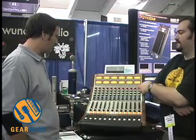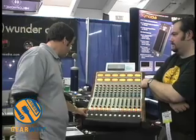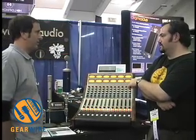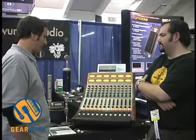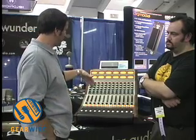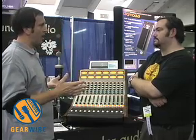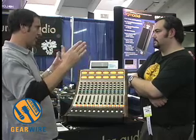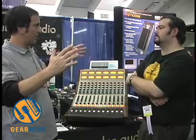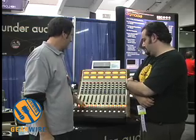The standard comes with a P&G conductive plastic fader, but you can upgrade it to flying faders. It's an all-analog piece no matter what. Another main difference between this and old frames is that if you pull out the modules, all the module compartments have sub-enclosures that are fully enclosed — it makes the board better reject RF and EMI, and it makes the buckets stronger rigidity-wise. If you're going to have eight buckets long, it's not going to sag. There's a lot of metal tooling that went into the enclosure here.